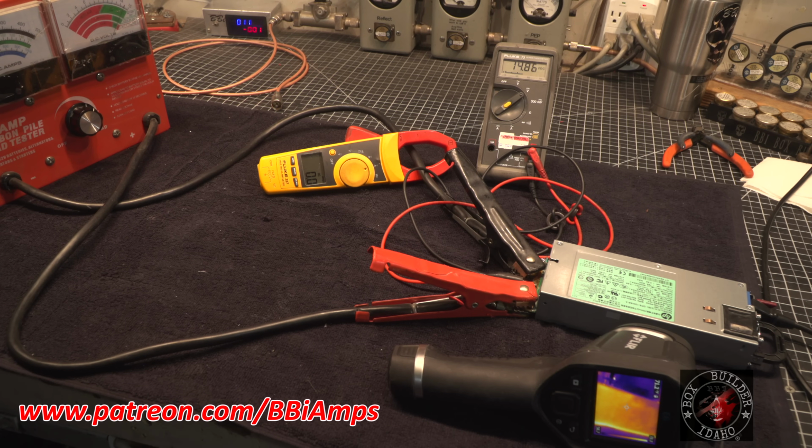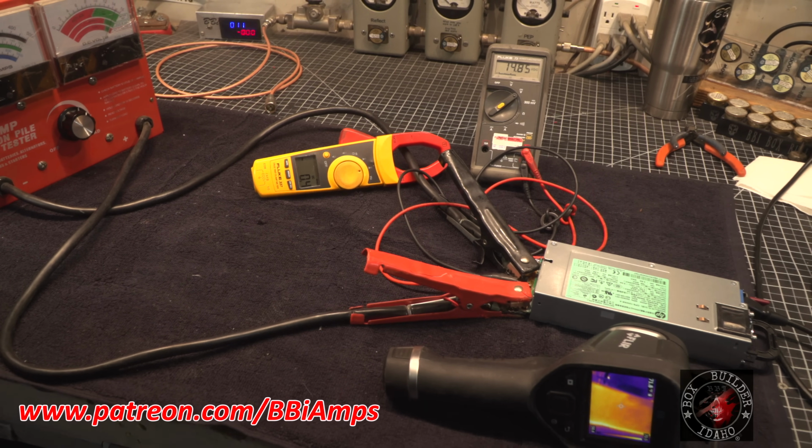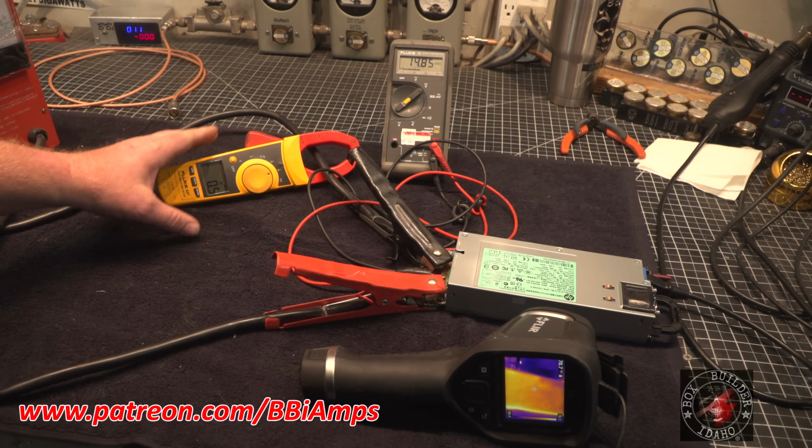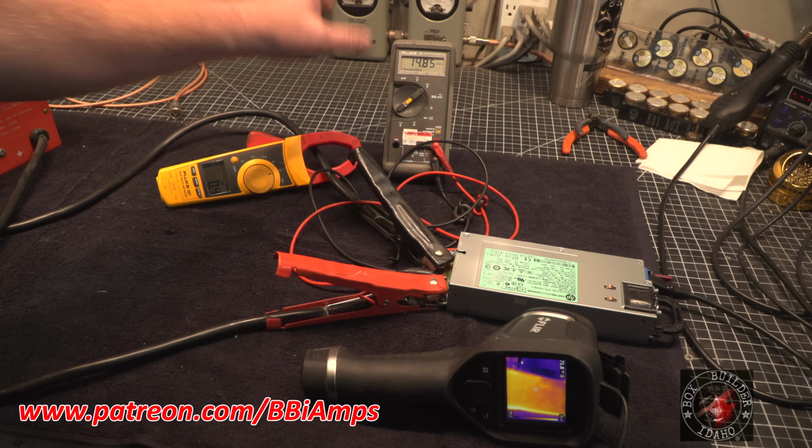We're going to put probably a 40 amp load on this, and we're just going to let this thing marinate. We're going to let it get hot, and we're going to find out where its cutoff point's at. So first, let's turn on the fan, which represents about a half an amp worth of load. So the carbon pile's got a fan going on it. That's what you hear.